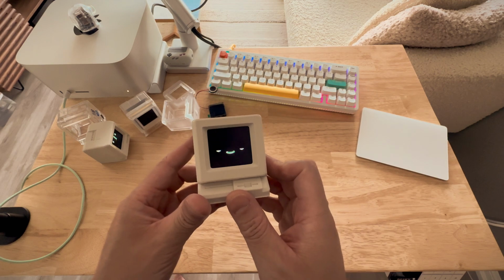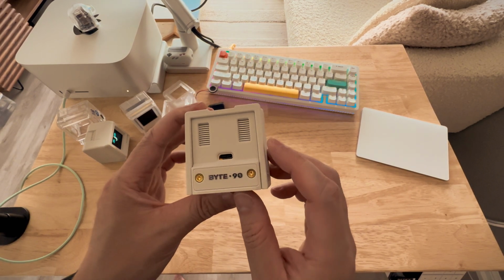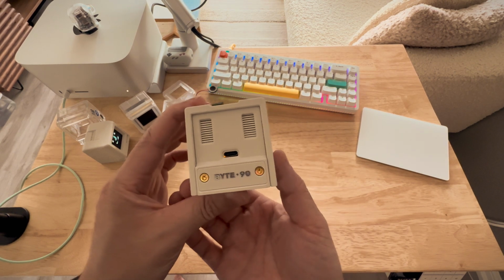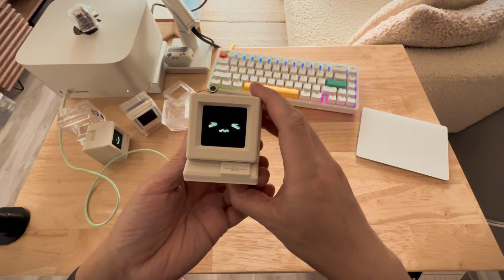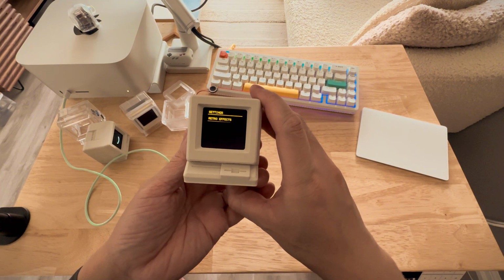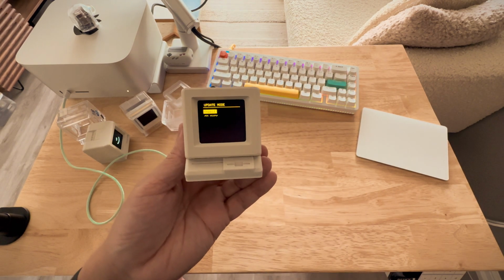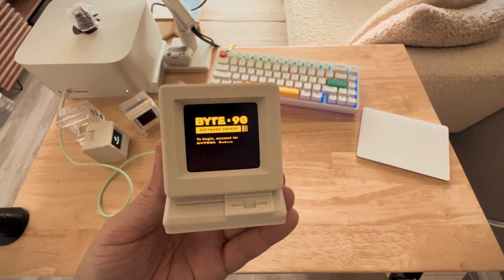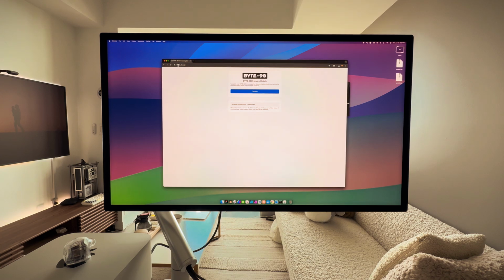So what I've done with the latest firmware here is that once you update to this firmware, for future releases, you could actually update via the web installer using the USB cable itself. I'll demonstrate this by plugging in the USB cable and then setting the device into, once again, update mode. Once you're in update mode, this time, instead of connecting to the access point, you want to visit this URL. And this is the online web installer.